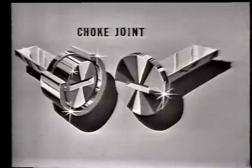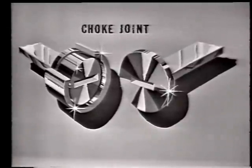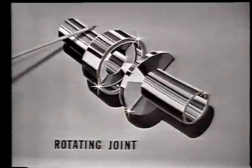Now, all of the sections of the waveguide must be connected together to make a complete system, and we cannot afford to lose any energy at these connections. So we use a choke joint to make the connections. The choke joint, through the use of standing waves in the slots, produces points of low impedance or electrical shorts at the wall of the waveguide. This type of connection is electrical but not necessarily physical, as in the case of the rotating joint. In the rotating joint, where we cannot have a physical connection, the 2 sections are physically separated and are rigidly supported so that one section is free to rotate and the other is stationary. This joint makes an electrical connection between the 2 sections of the waveguide.